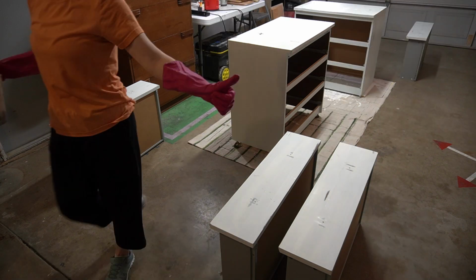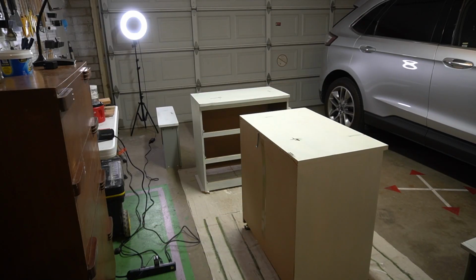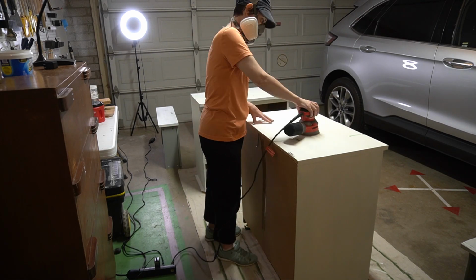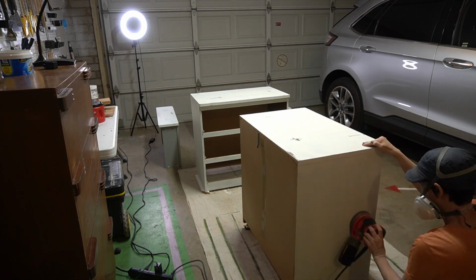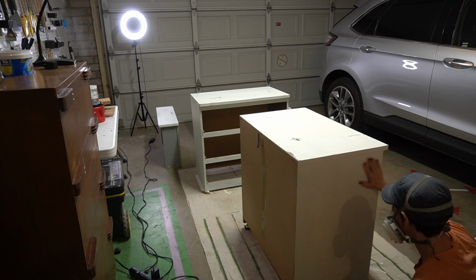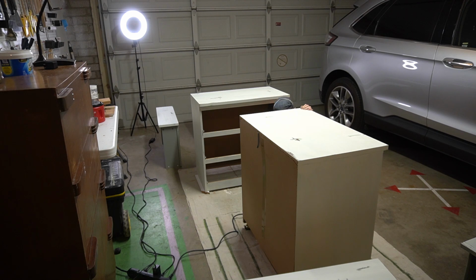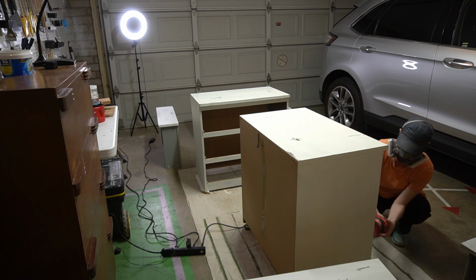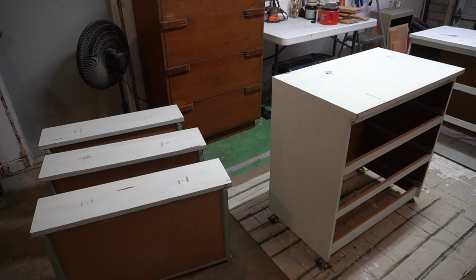Dressers from Ikea aren't necessarily bad, but these aren't made with the best quality materials. Since they're particle board with a vinyl thermofoil sticker, I'm honestly surprised they held up this well over the past 15 plus years. We aren't hard on our furniture or anything like that, but they've survived multiple moves, including one across the country, and constant daily use. Not bad. And because I did this finish, I know that it's 2 coats of dead flat varnish that need no more than a scuff sanding. I used 180 grit and my random orbital to get a good tooth for the paint.